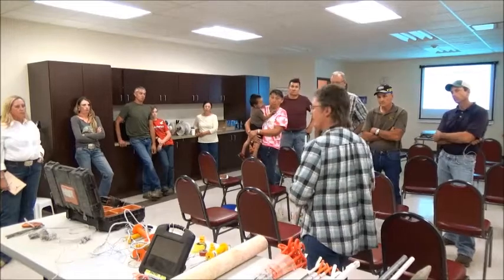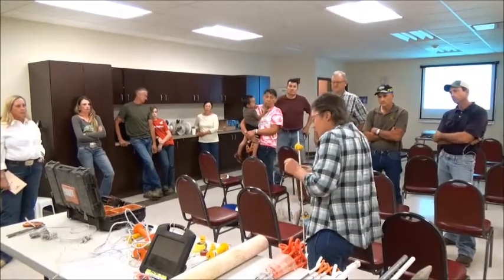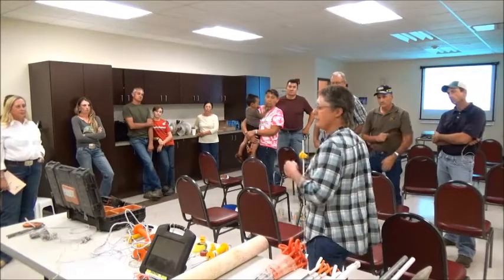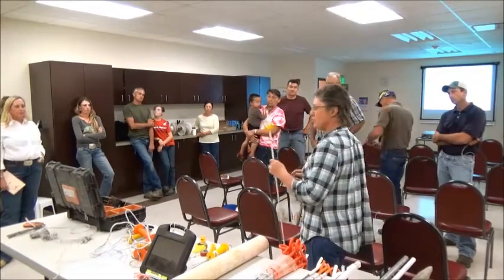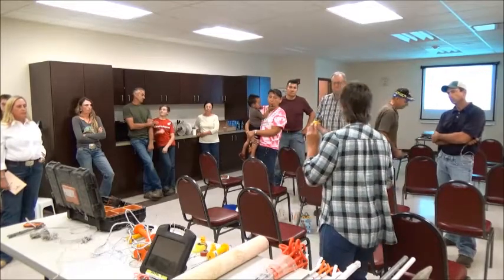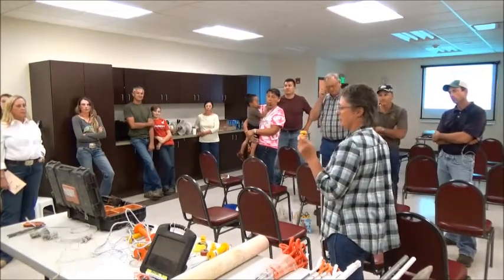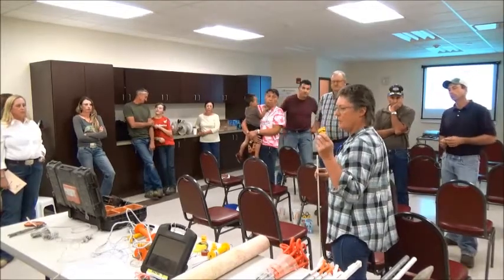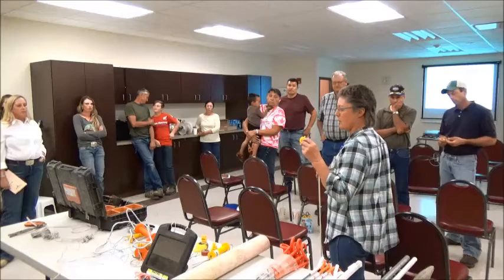Now in Nebraska, they like to use rebar, and they weld on a little triangle of metal onto the rebar and pound them in, and then they drive over them and they bend them. Don't. Just use these. They're cheap. The Dare insulators, the best thing about them is they're cheap. The worst thing about them is that they fly off easily when the cow hits the fence or the deer.